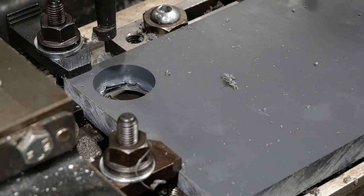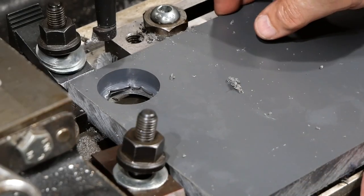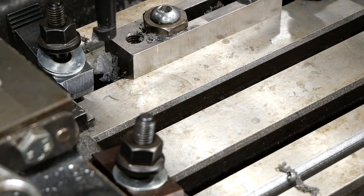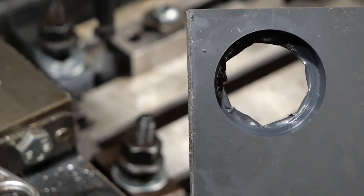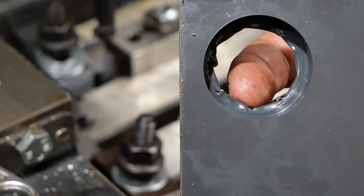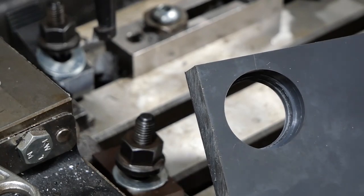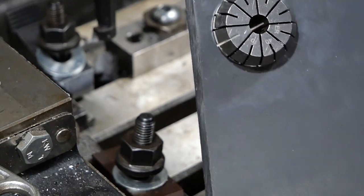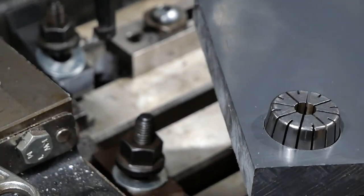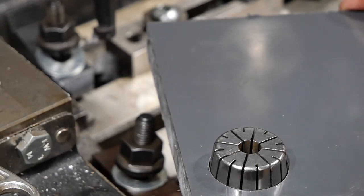so I think we'll take it out and do a proper test fit and make sure we're on the money, because the way I've got it set, I can easily put it back into the same place. Right. So I think you can see there's quite a bit of flashing. I've got to just cut out with a scalpel. Okay, so perhaps you can see inside the hole. And that fits neat as you like. Just turning him over so you can see that, so I'm happy with that. So 14 more of those, please.